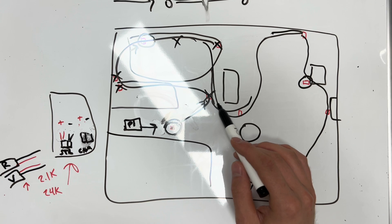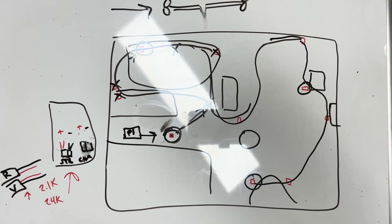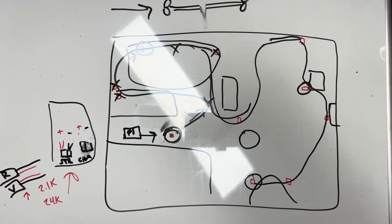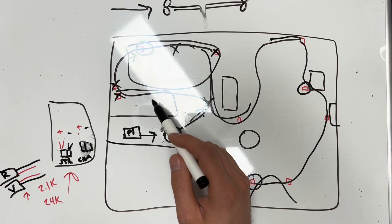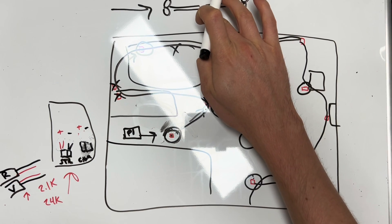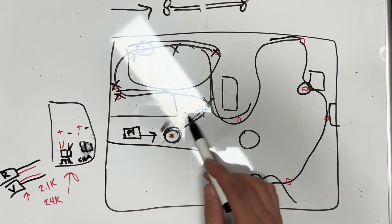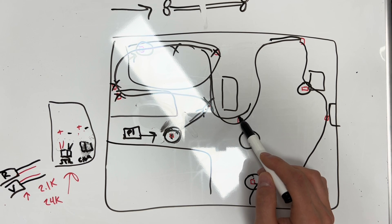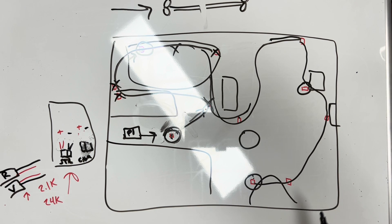That's a quick explanation of how to do fire alarm tracing for end-of-line resistors. Basically: disconnect the wires off the back of the device, use a toner and the wand that comes with it. You go box by box, but don't do them one by one in order — jump to the middle, then check left or right depending on where the signal is. It's a process of elimination. Toners run about $78 on Amazon and save you a lot of time.